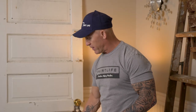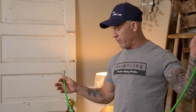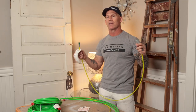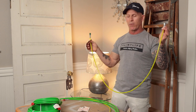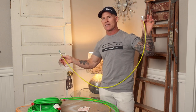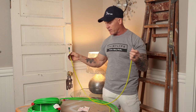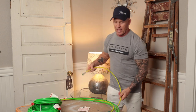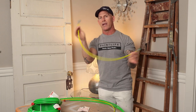We have three foot and five foot whip sizes, and that's really going to be personal preference. The longer the whip, the more you're going to have to push heavy viscous materials through it, which can start to limit the materials you can push through. But I've used three-foot and five-foot whips with elastomer coatings and never had a problem. I personally like a three foot whip — I use three foot whips on all my guns, and most of them are the exit flex style because they're significantly softer, more flexible, and cause a lot less wrist fatigue.